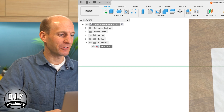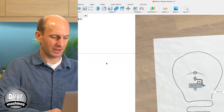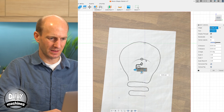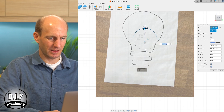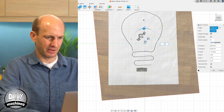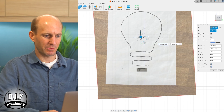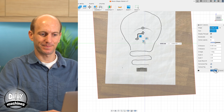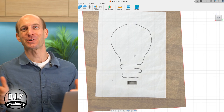Right-click again on your canvas and select Edit Canvas. Spin it around to the front, grab the piece and move it just above. Straighten it slightly — about minus three to minus four degrees — and move it a little bit more. There we go — you have your image for reference. Let's start drawing your shape. Spin the model around and select the rear face of our foot again, then go to Create and Sketch.